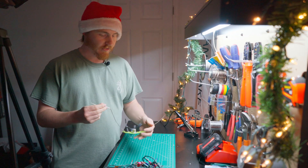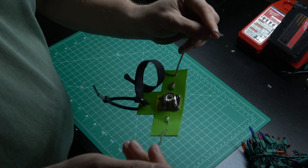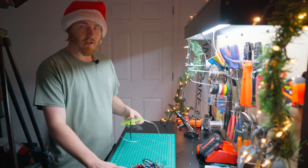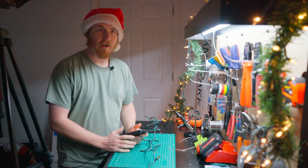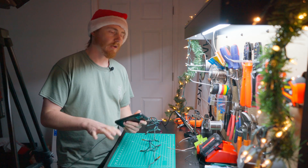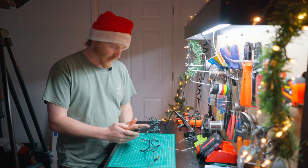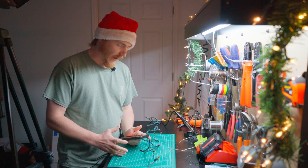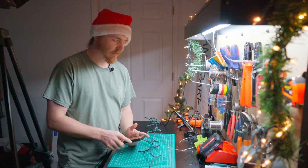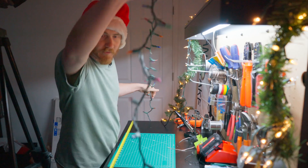This is what I ended up with — it's got these two legs on it right now, just a very small dipole. I've got both of the legs terminated and I'm getting ready to start prepping the Christmas lights. Everything is soldered up and screwed in. I want this antenna to be resonant on about 14.175 megahertz, which is kind of the middle of the 20 meter band. I want the ability to work both FT8 and sideband. For a half wave at 14.175 megahertz that's about 33 feet, and about 16 feet per leg for a quarter wave.